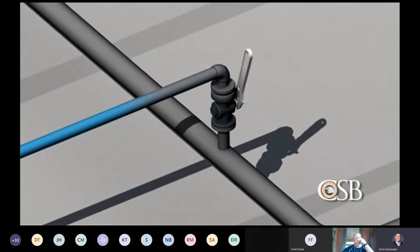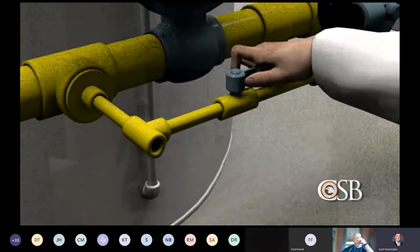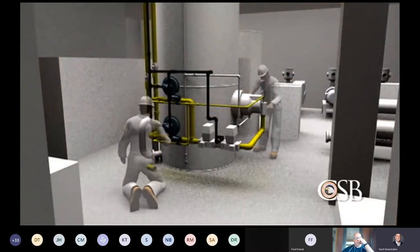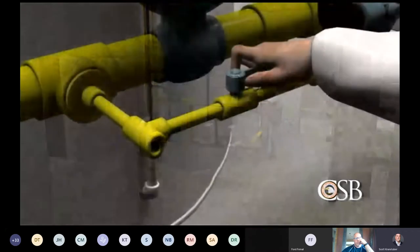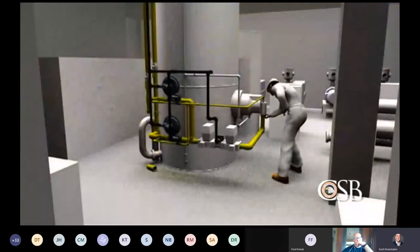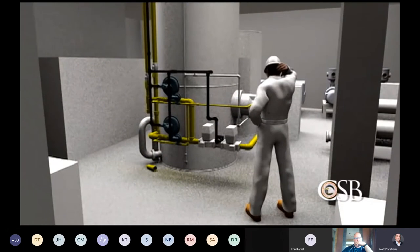The gas supply valve on the roof was opened. Then the ESA worker opened a valve near the water heater, allowing gases to escape through an opening in the pipe. However, he was unable to light the heater and evidently concluded that this was caused by air remaining in the pipe. So he continued venting the pipe intermittently into the utility room over 2.5 hours. But the air had left the pipe and invisible natural gas began entering the room.